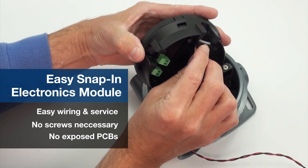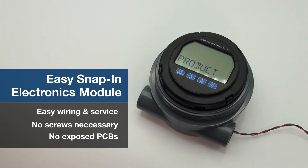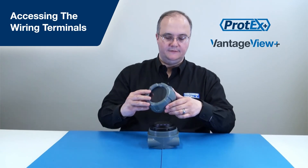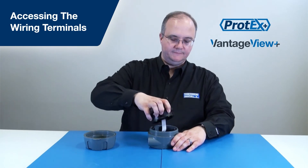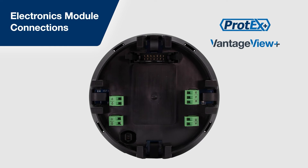There are no exposed printed circuit boards to risk damaging or contaminating. All electrical connections are made to the removable terminal blocks, making them very convenient for installers. Accessing the wiring terminals is quick and easy — simply remove the cover, pull on the electronics module to remove it, and if necessary, detach the top of the electronics module for easy benchtop programming. The removable electronics module includes a USB port for programming with PC software, as well as depluggable connectors for the 4-20mA input, open collector outputs, and digital inputs. The electronics module is also easily replaceable.